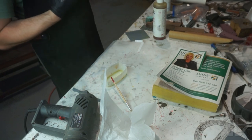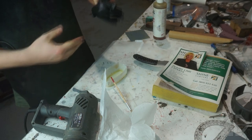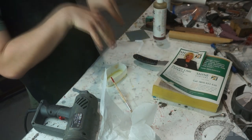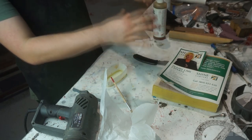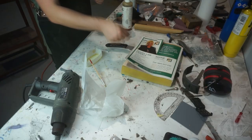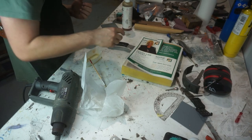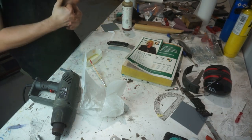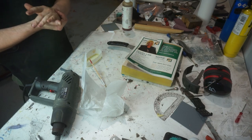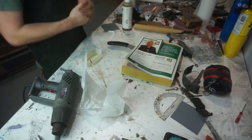We'll be coming back every five minutes at first to flip and rotate this, because you don't want all the epoxy to settle down due to gravity and pool at the bottom — one side would look great and the other would look bad. Constantly flip it and check it to make sure you get a nice, even look on your paracord. After the first few rotations, check it every half hour to an hour as it hardens up. It's a feel thing — I've messed up a few of these to get comfortable. But this is going to give you a handle that is solid and permanent. You can do a kydex sheath over it. It's much more durable, though you can still remove it with a chisel. It's an option to solidify a paracord wrap with the look of a Japanese-style handle wrap — solid, durable, and good to go.